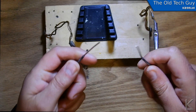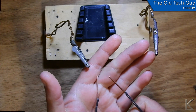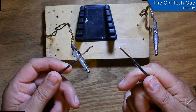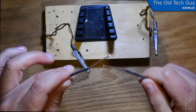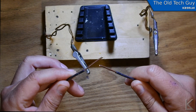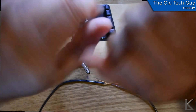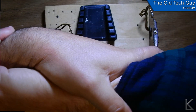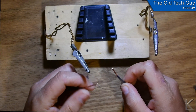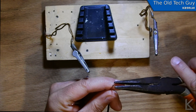Splicing two wires — here we have some solid copper wire, and you can see I've already bared about an inch and a half on each end. What would be the strongest way to splice these together? Well, there's a thing called a lineman's splice, and it's what I like to use, and it looks like two hands gripping each other.